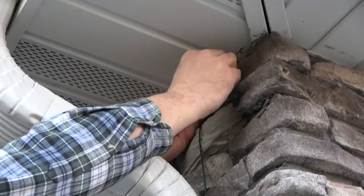Next, I returned to the office. I installed the wall plate housing by sliding it over the cable and inserting it into the wall, then secured it to the drywall with four Phillips head screws. The plate was installed over the cable in the same fashion and secured with two flat head screws. Finally, I installed the router. On the bottom of the router are two connecting ports — I plugged the Starlink cable into the one on the left and the power cable into the one on the right. The router was then plugged into the wall outlet, and a small LED light came on indicating power.